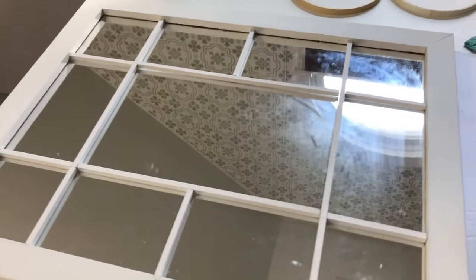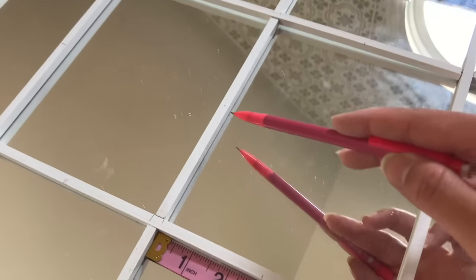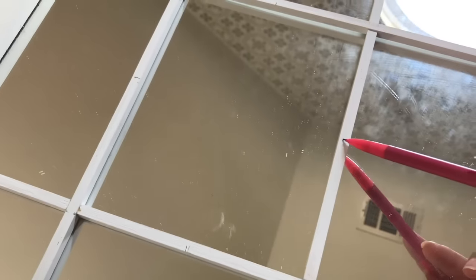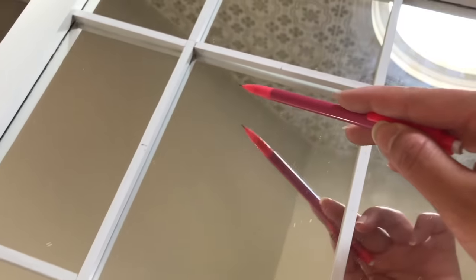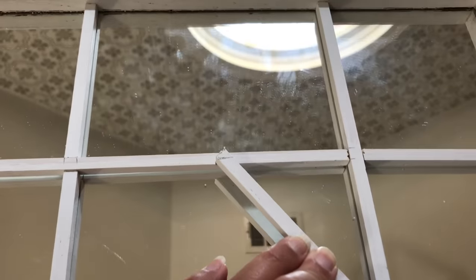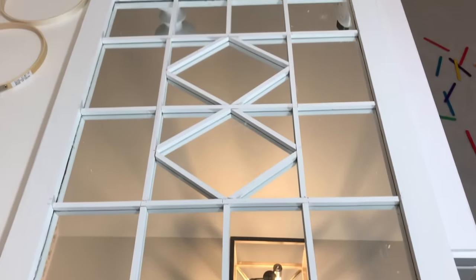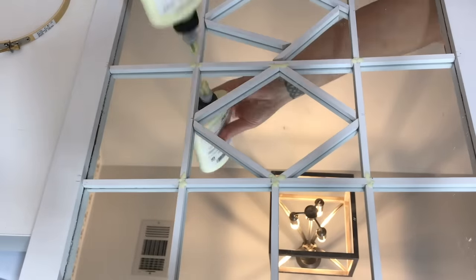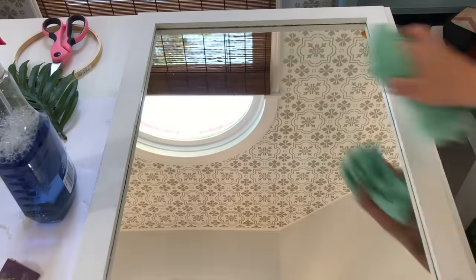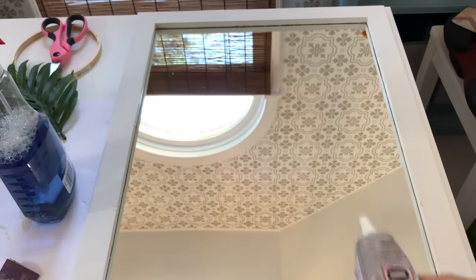Here is just a snippet of the progress as I continued. Next I had to design the diamonds that went in the middle — I took the two center rectangles and marked the centers so I knew exactly where to place each individual piece to create those diamonds. I placed the dowels, made my markings, and made the cuts. Once inserted, I went in and added wood glue on all the seams. Then I removed the grid once everything was dry, sanded it down, and repainted it. Then I cleaned the mirror and reattached the grid back onto the mirror with some E6000.